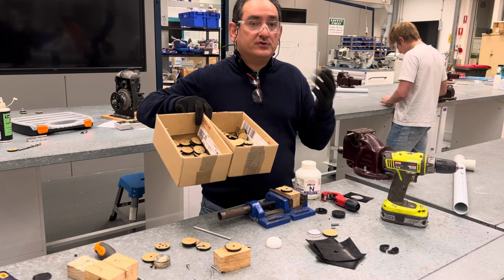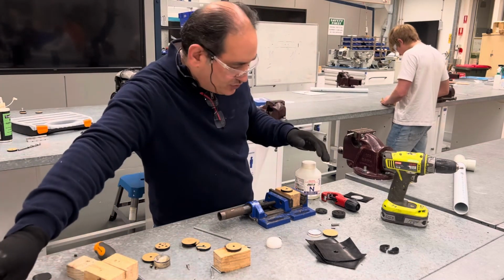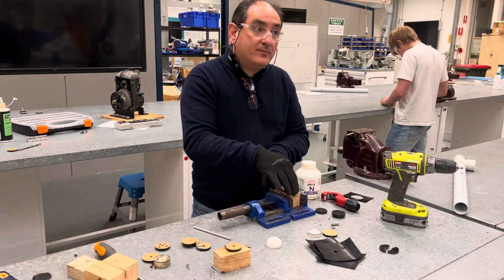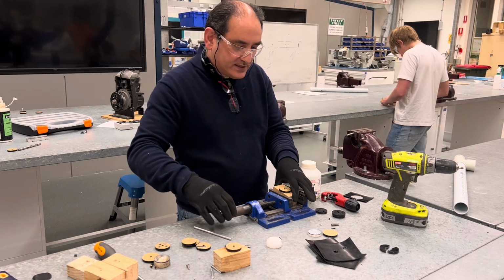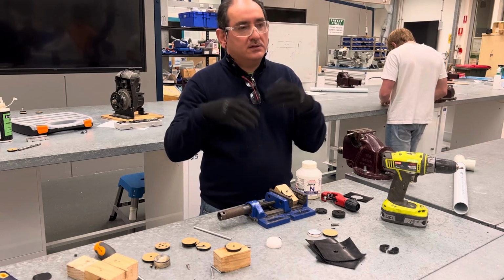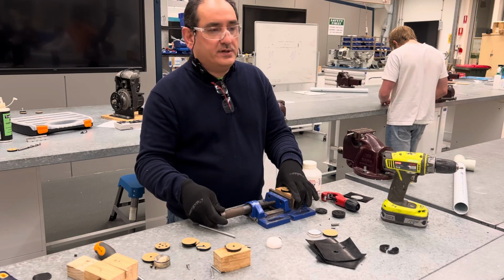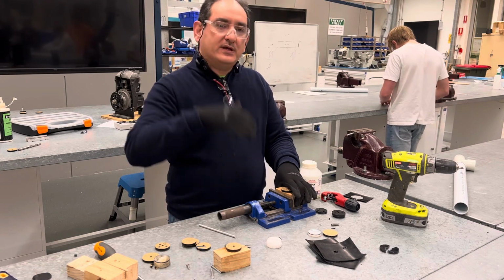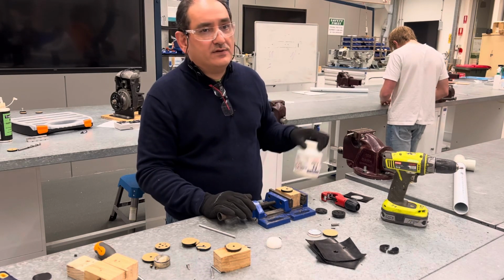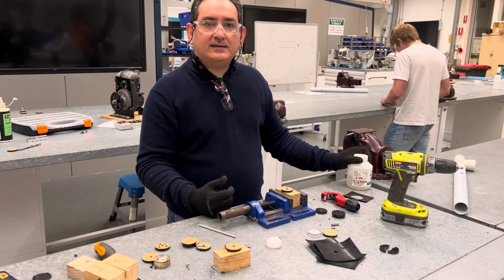I can show you how to do the drilling operation without damaging the part. The first thing is that your fixture should sit in the middle, supported by both ends. If it's flying from one side, it may go down and the drill tip will break the whole part. So the feed rate should be very slow, and this is also going to prevent the part from breaking. The next step is we're going to go to the machine and try to drill 3 parts together, and this will shorten the time required for the machining, which is of course important in real life. So we're going to work on that. Thank you for the recording.